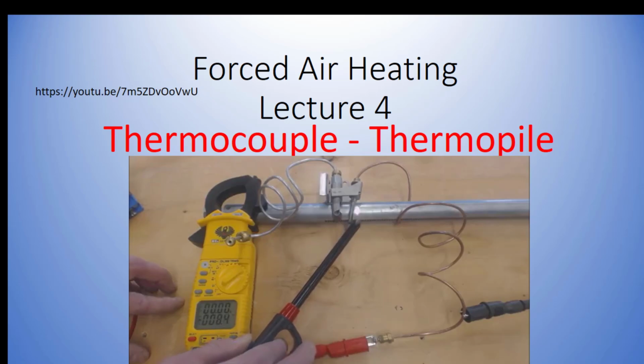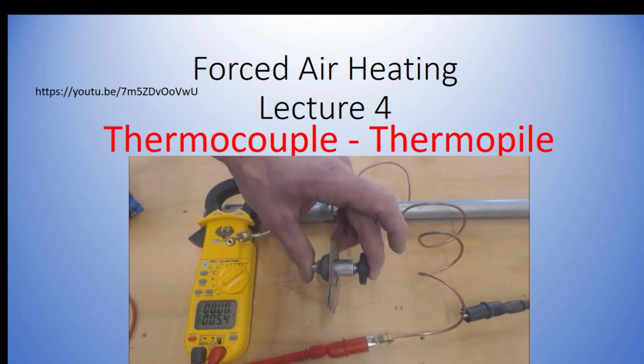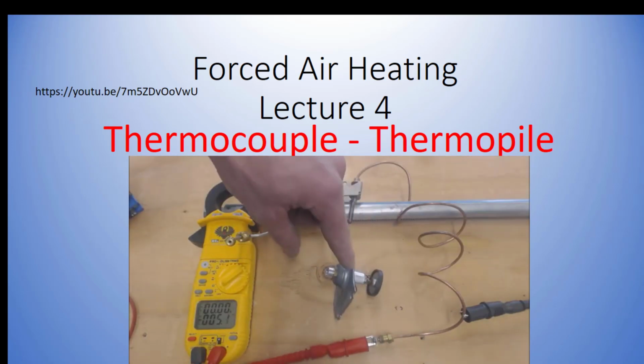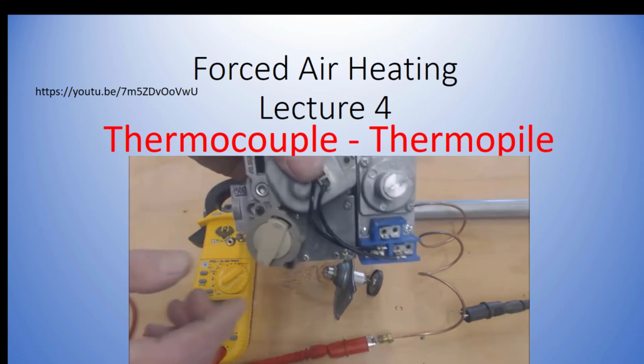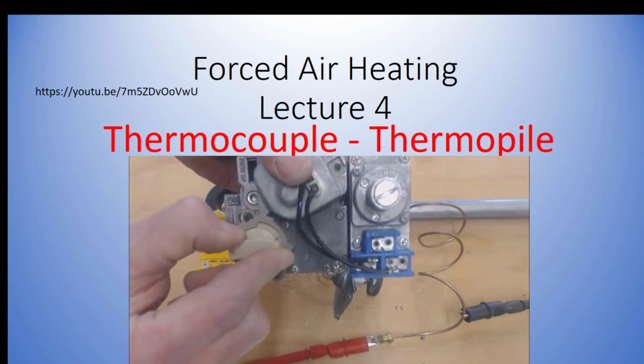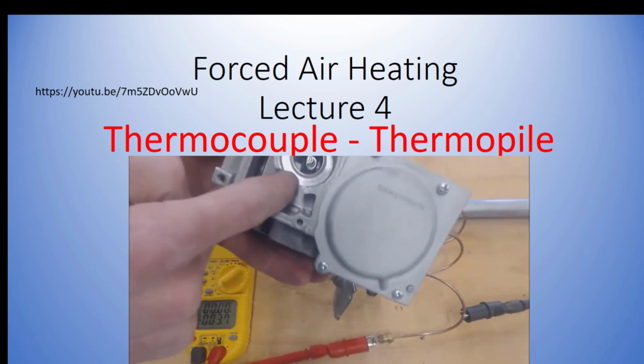All right, and this is a very tiny flame that you see. So you see that the voltage is going up. It doesn't take much millivolts in order to hold that solenoid in place. So a larger flame would be able to get around 30 millivolts. All right, so that's what opens the gas to flow through the gas valve and to have the continual pilot flame being lit. After you have your pilot flame lit, you can go ahead and turn this to the on. Then once again, you can just go ahead and power it with 24 volts.